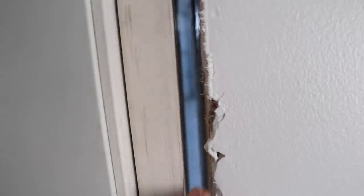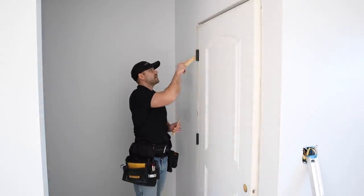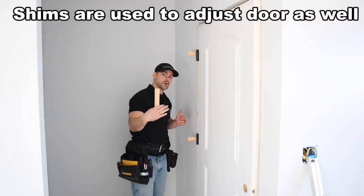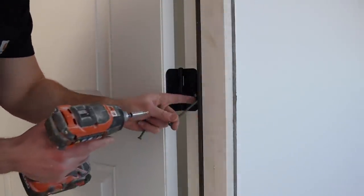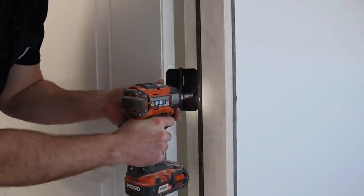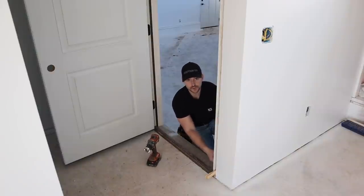Make sure to leave about a quarter-inch gap on each side of the door for insulation — if it's tight against the opening there's nowhere to put insulation. Before driving each hinge screw, take shims and push them in tight behind the hinge area; otherwise the screw will draw the door frame over too much. Always put shims in first. You may need to remove the original hinge screw to replace it with a decking screw. For the bottom corner, pre-drill and place a trim nail, pulling back the weather stripping so it hides the nail.